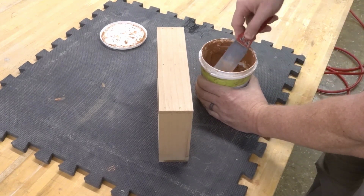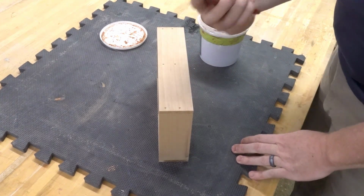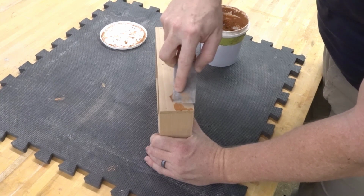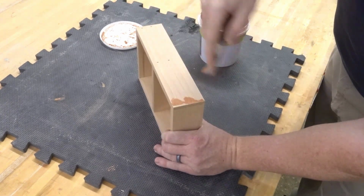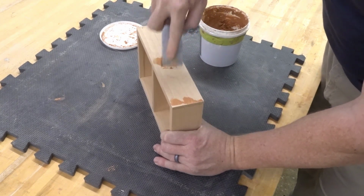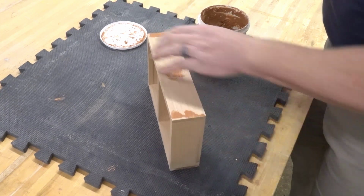And take a little bit of putty. You won't need a ton. Please don't just dig and get a ton of it. You're just going to waste it. Okay, and what you do is you squeeze it in there. Squeeze it in there. Okay, and then scrape off the extra. So squeeze it on heavy and then scrape it back off again. The more you can scrape off, the less you've got to sand it.